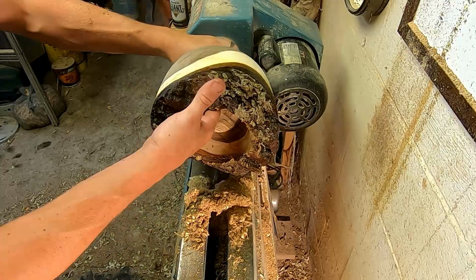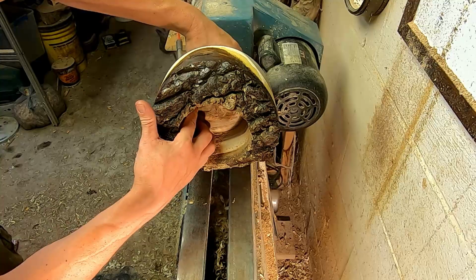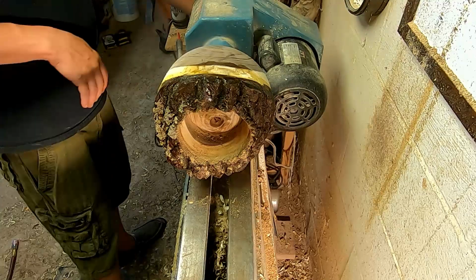Call it there for tonight. We're about halfway in. I'm just gonna restart the drying process. I don't want to go too fast. I do not want to initiate any cracking, especially now as I'm finding that we got a knot running through the center of our piece, getting a little grabby. So yeah, we're just gonna go ahead and reset the vacuum chamber and start fresh tomorrow.